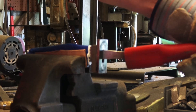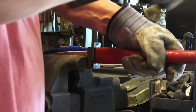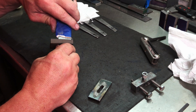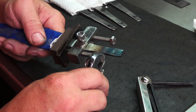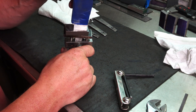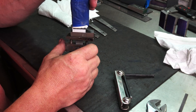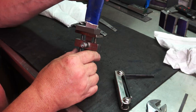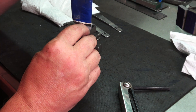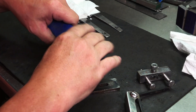I put it back in the guard jack to see what it looks like — it's going to be too tight to put on and off by hand with a press fit like this. That's a whole lot better. What I'll do next is take it to my microscope and cut into those impressions with a burr — I learned to do that from Kyle Roy. You can use a mill to cut some of it and then go to the burr, but I just go straight to the burr. There's just a little shadow there I don't like, so I'll take it to the burr and finish that up.